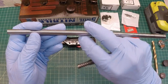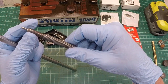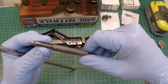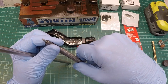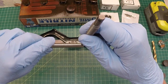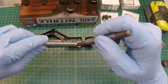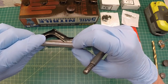When I drilled the hole for my tap location, I used a tool I think I've shown before. Spring Tools actually manufactures this tool as well as a chisel. I use the chisel to remove old rivets and it works like a champ. You can see it's spring-loaded — this thing drives enough force; I think it was rated about 3,500 psi that you can generate. So when I've got this tubing in the vise and I want to create my set point for my drill location for that number 36 drill bit, it's really simple and easy to get a nice starting point. Otherwise your drill bit is going to be all over the place on this round tubing, especially being stainless and not soft like brass.